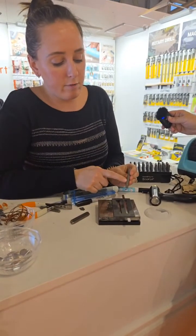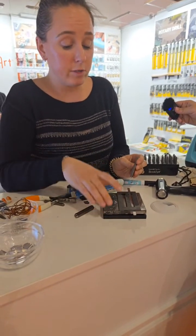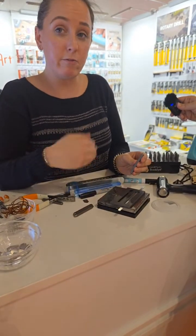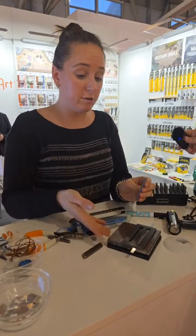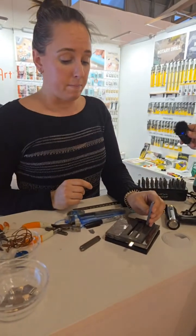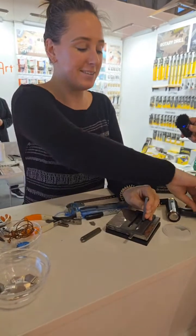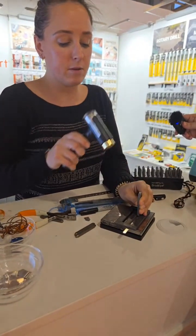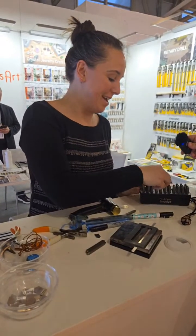Then our stamps have our logo on it as well as the letter. If it's facing down, the letter is going to be impressed in the middle. If the logo is facing the stamper, it's going to be in the right way, not upside down or backwards. You don't want to mess up, because then you need a new blank. And I would be the one to do that. You hold the stamp in your non-dominant hand, line it up with the line on the jig, take the hammer, one hard hit. Maybe that's what I was hearing. I kept hearing a clunk, clunk.